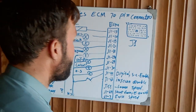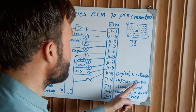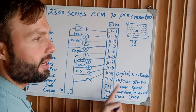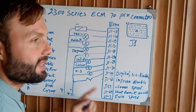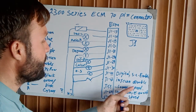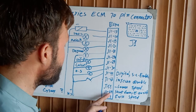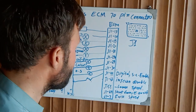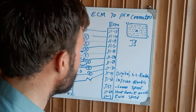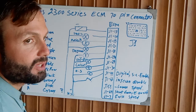J1 pin 62 is the injection enable. This works for the injection enable pin, sending a pulse to the injection system. J1 pin 59 is the lower idle speed, working for the lower idle speed system. J1 pin 64 is the shutdown emergency override — this pin goes to the shutdown emergency override switch. J1 pin 70 is the raise speed, used for raising the speed of the engine.